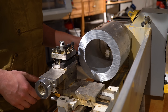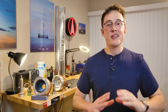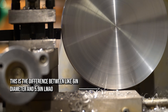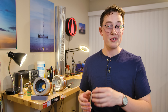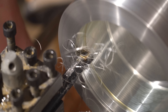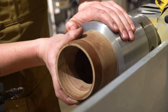Lastly, we need to turn the aluminum nozzle carrier, which started out as a short, thick section of 6061 tubing. My eBay lathe can turn up to six inches in diameter — kind of. It can turn like 5.9 inches on a good day. If the part is bigger than that, it just rubs against the carriage, so bit by bit I had to turn down the total diameter of the stock material before I could access all of the part. I upgraded to an even beefier boring bar and started turning down the inside, using a ton of cutting fluid. Same as with the phenolic, I did test fits as I went using the actual parts rather than staying exactly true to what the CAD said.